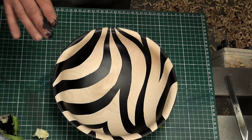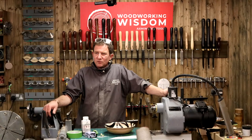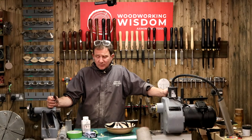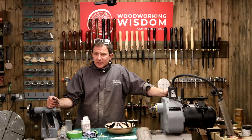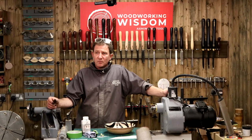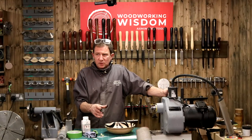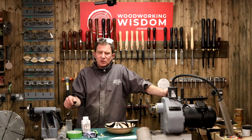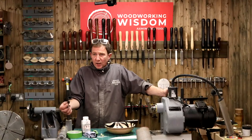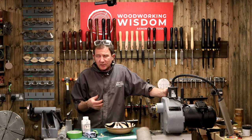That would be fine. If you're going to start putting salad in it now, you need to think a little bit more, okay? So that's a tricky sort of thing. If I was going to go for a salad bowl, then yes, I would probably be doing something like the spirit dye. Paint it, let it dry, and then oil finish after that and build it up. All right, so you can even go with food safe oil on top. Be worth playing with a little bit before you start your bowl. So do a little scrap piece of wood, just see what happens, all right? That's something important because the oil will darken that dye as well. And obviously with the dye, when you put it on, you've got to make sure your end grain fibers are really, really cleanly sanded, or that's going to pull into those a lot more.